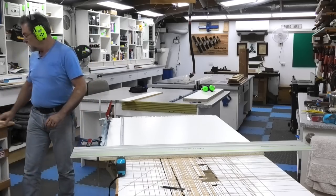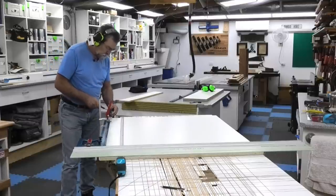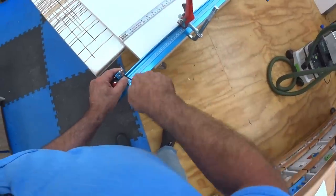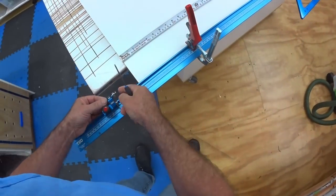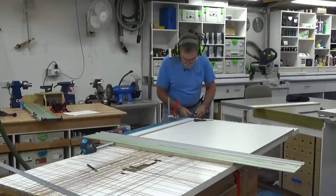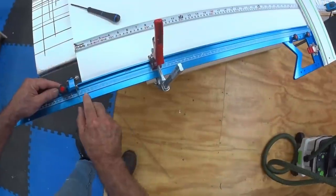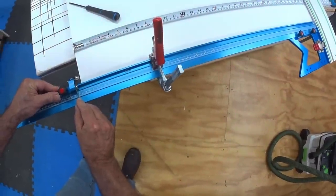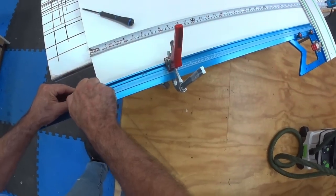You can see here that the splinter guard is back just a little bit, so 1070 is spot on. Using the three-millimeter hex screwdriver, I'm going to back these off and that one, so this can now move to wherever I want. I'm going to move this up to 1070 millimeters, looking straight down over the top, and lock it.